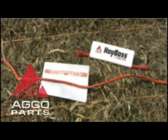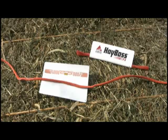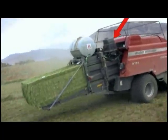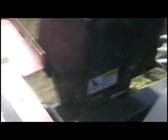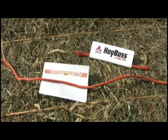Now there's an innovative system to make that possible. The AGCO HayBoss G2. This innovative system puts a tag on every bale you make as the bale is tied. A unique mechanical device is mounted on the top of the baler. After the first knot passes, two fingers pick up the outside twine. A tag is inserted under the twine. As the twine snaps down,